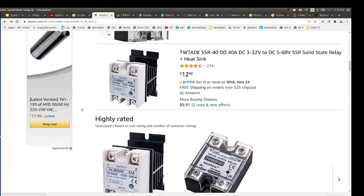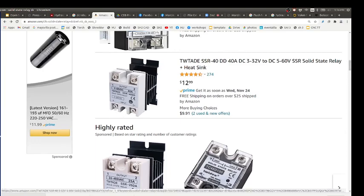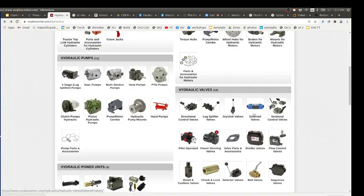And these solenoids, are they continuously on while they're fed power and then automatically shut when they're... Yeah, they're normally off, meaning that when powered you close the connection. Okay, so it's only momentary that you would be passing current. Whenever you need to. Yeah, so the logic in a brick press would be, the cylinder is moving one way, you keep it on for all that time so it keeps moving. When you stop it, the power goes off to that particular solenoid. And we've got two of those bidirectional solenoids. The ones like this, but different. They're the black ones.